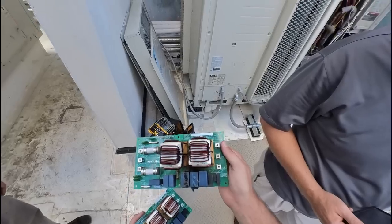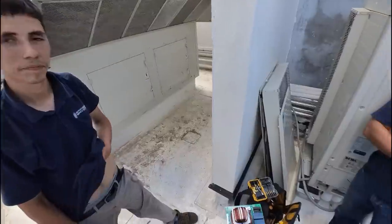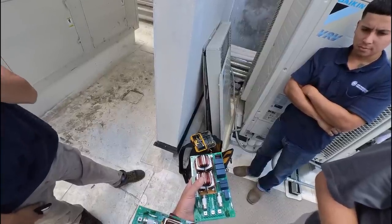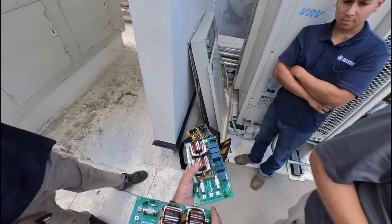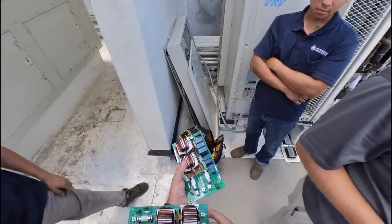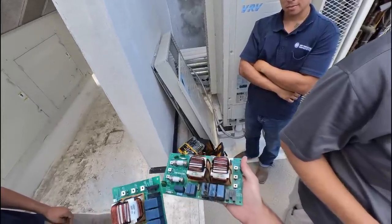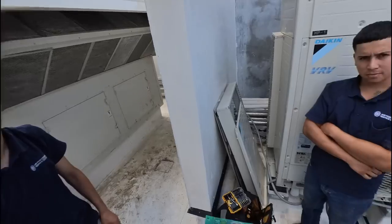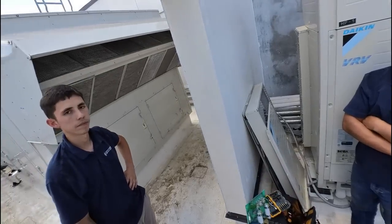See, even that diode there got cooked on top. These are capacitors — little snubbers, 2.2 microfarad — part of the cleaning. These coils here act like line filters, harmonic filters — a bunch of wire wrapped around the core — and they help take the irregularities of the power stream out of it. These capacitors serve as a filter to help smooth out the power passing through. So LB, LA — this is our input side, this is our leaving side. Let's take a quick look at that inverter and make sure there's nothing obvious.